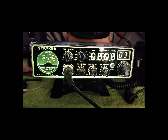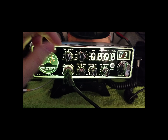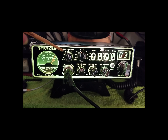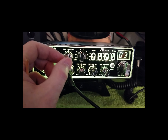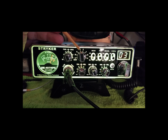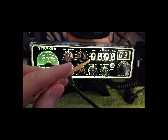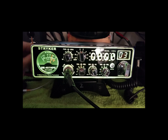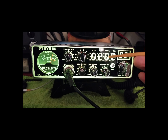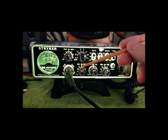Here's the front of the radio — you've got the nice round S-meter, microphone jack here. Starting from the top: talkback is the outside dial, power is the inside dial. This is your bands A through H — once converted, band D will be the band for CB. AM, FM, or PA are right here. Roger beeps are very simple — not the fancy ones like the 655 or 955 — just basic beep and beep-beep. Noise blanker, ANL on top, noise blanker in center, off below. The 10 KC switch is either off or on.